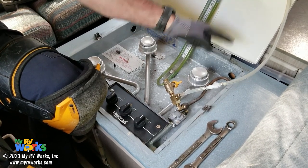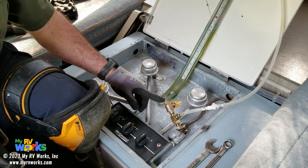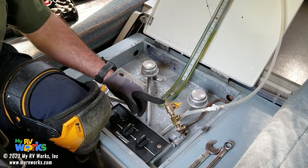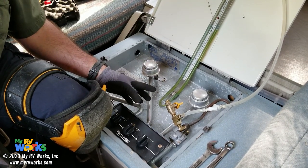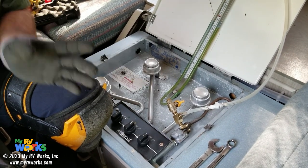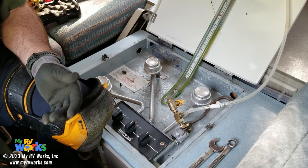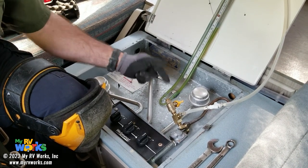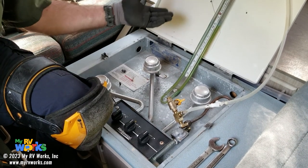So I've connected my manometer, I've zeroed out my meniscus, and my point is this 50% load, the 41 hole represents 75,000 BTUs. There's no way it's going to be right. So I'm going in with eyes wide open, trying to explain that to you. If we were doing pop-up campers or truck campers or something really small all the time, then we would change out this plug with one that had the right size hole in it that would match the right BTUs.